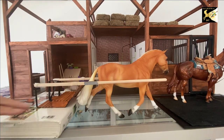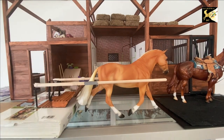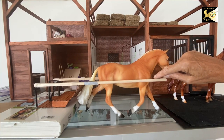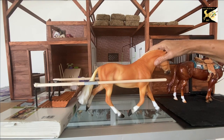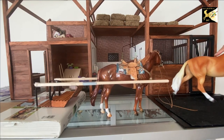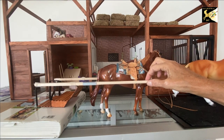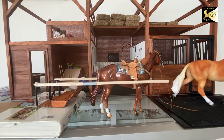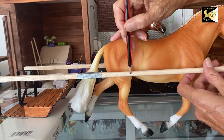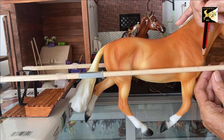I have put this piece on a book about the same height as the wheel. So the wheel's going to run through there. And I've taped on the shafts where they belong. So you can see that the horse's butt's going to come to there, and we want the shaft to end around the center of his shoulder. Now if I take this model out, stick in a different one, again lining that up at the same spot, you can see it's going to be a little shorter this time. So you're going to determine where you want to cut this if you're going to use it on multiple models. Based on the horse's shape, the shaft should come in a little around here and then straighten up. So I'm going to cut it to fit this horse and mark that,